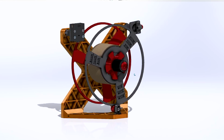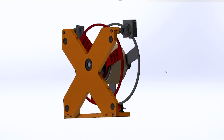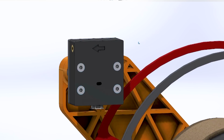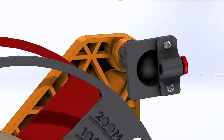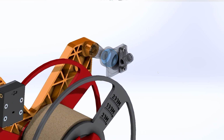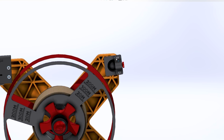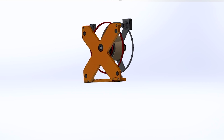that roll of filament. Now, to take things a step further, I also designed this spool stand, and this is called the Spool Stand X. Now, it's not just for the K1, and as you can see here on the two top corners of the Spool Stand X, you can accessorize with things like mounting provisions for Creality runout sensors, as well as this PTFE tube guide. Both of these are on ball joints to make sure that the filament is never being pulled at weird angles.